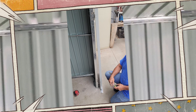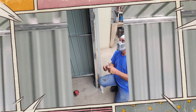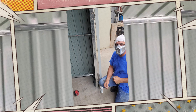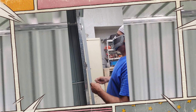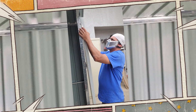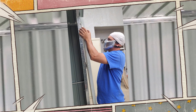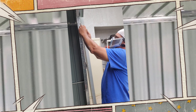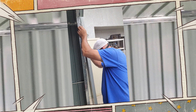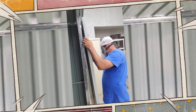I set something underneath to raise the door a little bit, and I have it at an angle so that way it kind of raises this side up a little bit more, even if that side is on the ground. Any time you're hanging anything, you always want to start at the top. If you started at the bottom, you'd be struggling with the top, swinging on you way too much, fighting the weight of whatever it is you're hanging. If you start at the top, you're only going to have to worry about the inconvenience for the first hinge. After that, everything will line up and everything will be good to go.